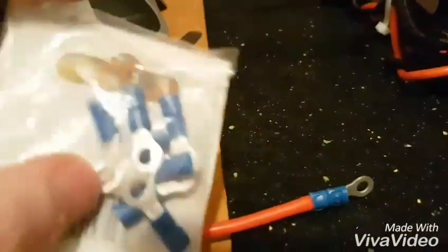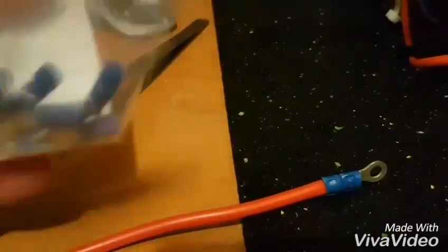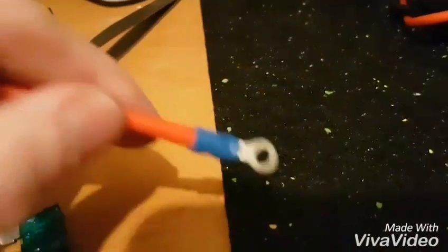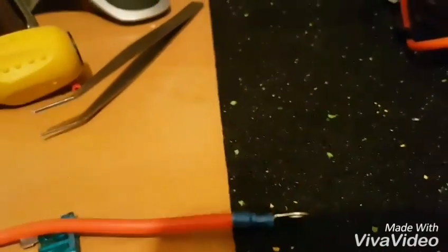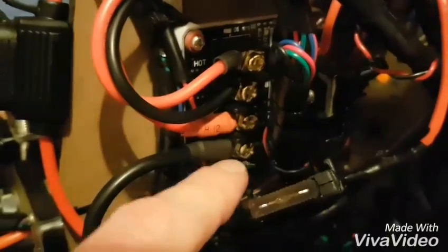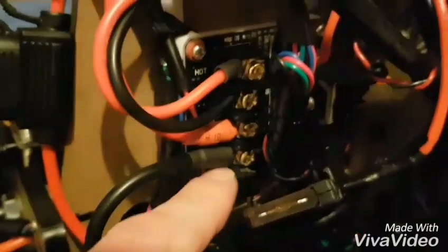The way around that is to get insulated ferrule crimps. You push them on and then crimp them down — you can do it with pliers, but for a tenner off eBay get a proper crimping tool. The cable should come through the end and be fully scrunched down, giving 100% contact all the way through onto the terminal. Just periodically check these, because if they work loose that is when people get melted power connectors.